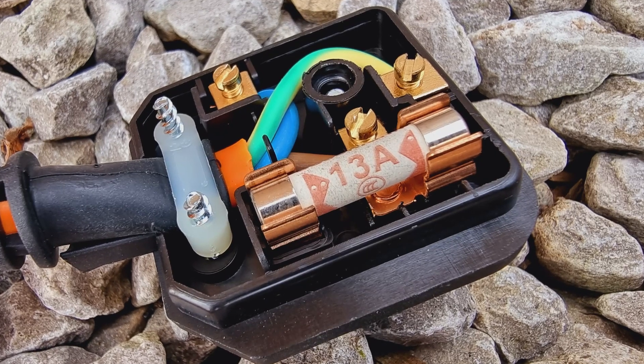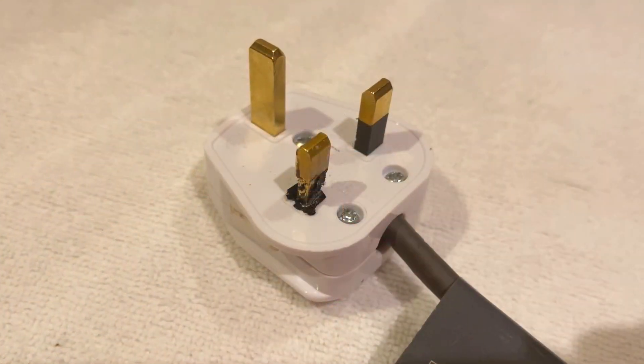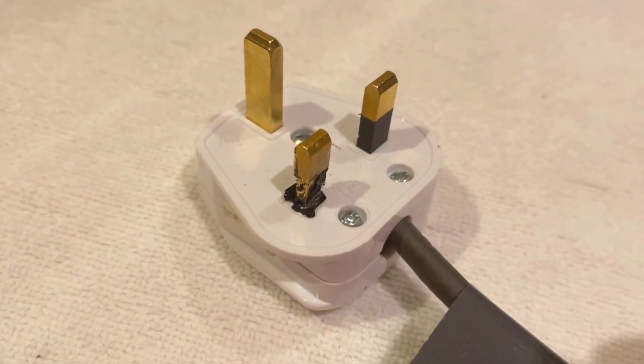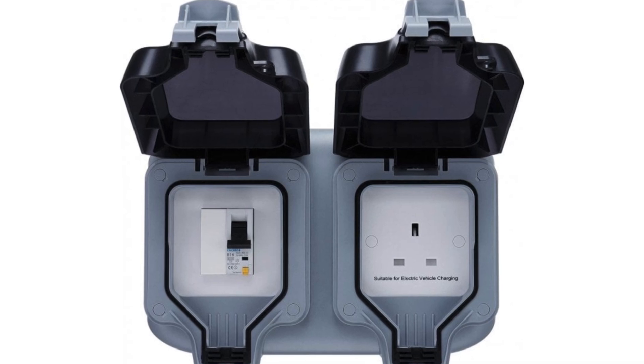You may be wondering why, if there's a little fuse in the plug top rated at 13 amps, you can't access those extra 3 amps. Well, the simple answer is that BS-1363 sockets and plugs aren't designed to deliver 13 amps of current for extended periods of time, which is why you'll sometimes see a burnt out line terminal but an intact fuse in the plug top. That's why if you do decide to use a BS-1363 socket outlet as an EV charge point, it has to have that EV marking on it to show that it's been constructed and tested to deliver a higher sustained load. But even with this additional assurance, you're still not going to be able to charge with more than 10 amps for a sustained period.